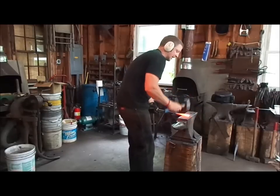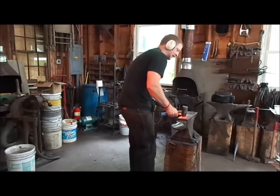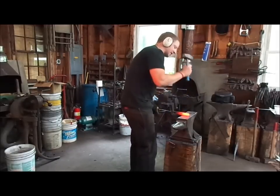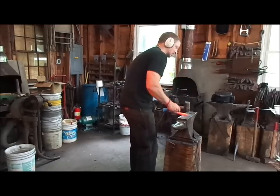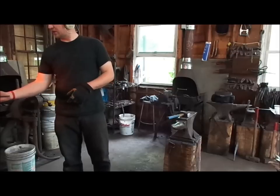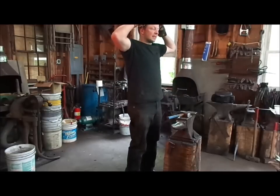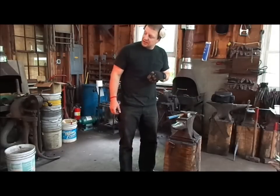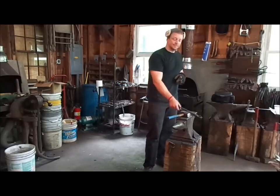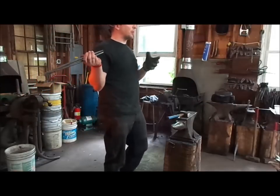This bar was the top center of the puck, and it's therefore a little crunchy — it's got some cracks and it's already cracked up. So I'm just working it down. I'm going to take the best piece rather than discard it, because I'm going to actually use it. You could have it be part of the tang of the blade where it's in a handle — you don't need the same kind of strength there. I try to avoid cracked material as much as possible; you just never know what you're getting. This material is about 1.5% carbon.